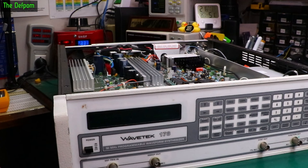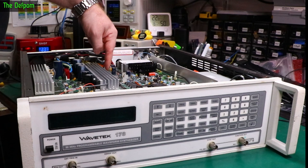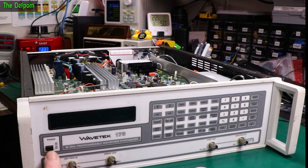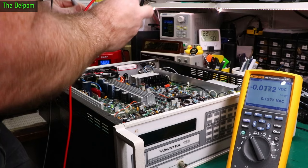I was wrong — this connector here isn't from the transformer. It snakes around to the other side of the board. These labels on the board here are the actual test points, so I can measure the voltages in this plug. I noticed this plug wasn't pushed right down, so I just gave it a push. Let's try it again. Wasn't that — that would have been easy. Oh well. Moving on. Let's test this power rail and see what we're getting. I've set it to DC and AC so we can see both — if there's any ripple on the lines we'll get to see that as well.